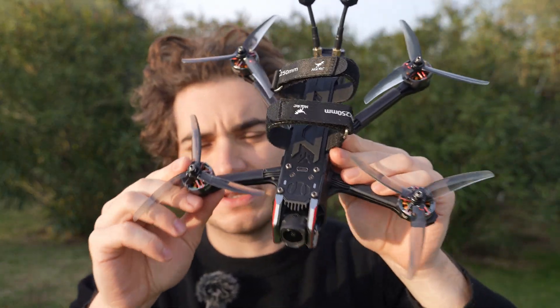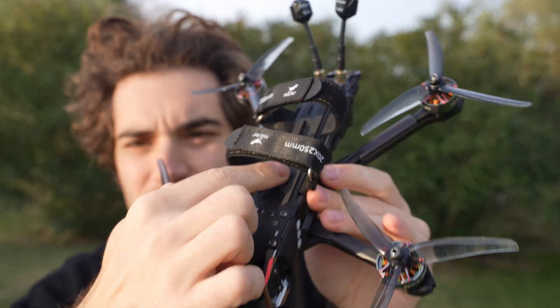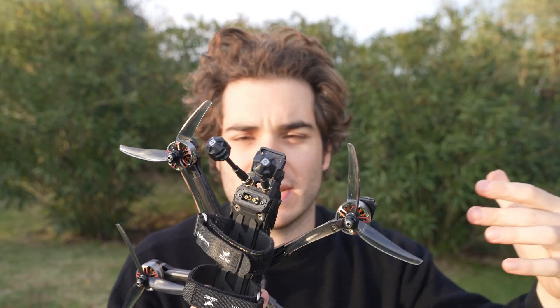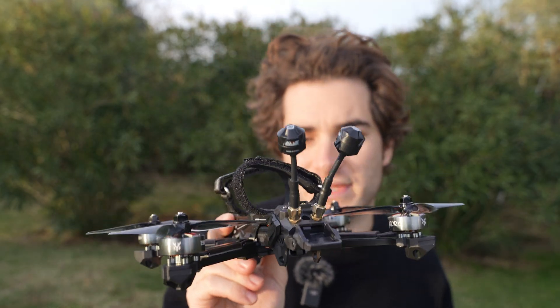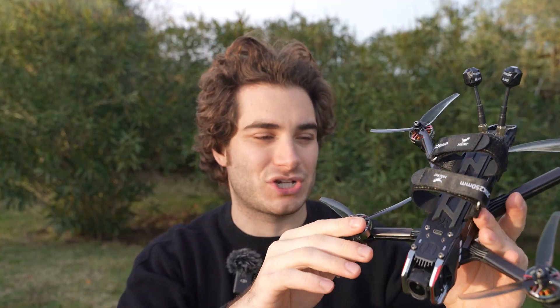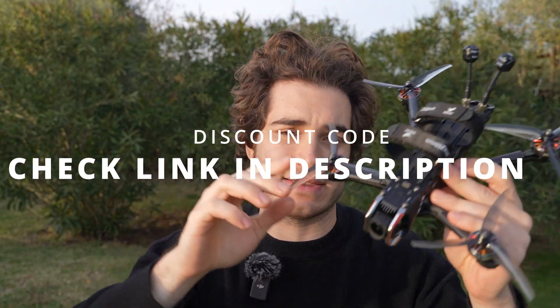Another small issue with the without-camera version: they don't provide the screws to mount the camera in the front or the VTX at the back. There's no O3 or O4 cable included, though you can get it from the camera itself. Also they don't provide the antennas — they made the holes big so you cannot use the stock DJI antennas; you need analog-style ones. I had to take them from another drone because they weren't provided, so be sure you buy them. That's all for today. Remember to like, subscribe, and comment. Let me know what you think about this drone — I feel like it has great potential and I can't wait for it to be good. Check links in the description for discounts, subscribe to stay updated. Stay safe and happy flying!